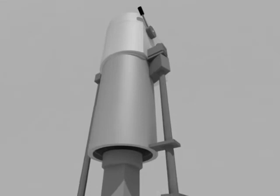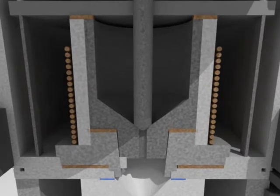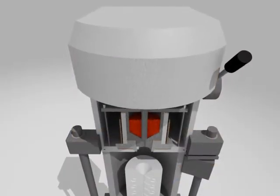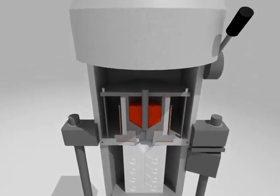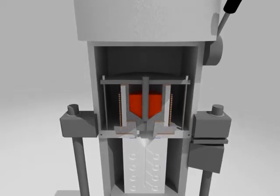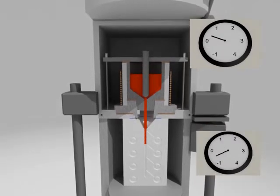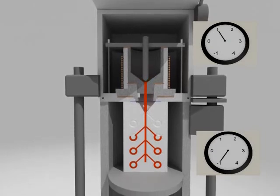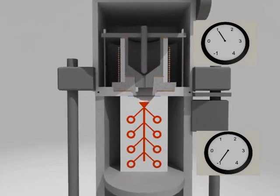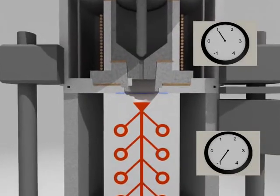In the separate chamber machines, the syringe effect is guaranteed by special gaskets and cements underneath the crucible to keep it sealed. After the vacuum is applied, the flask is pushed against a silicone gasket and inert gas is supplied. When metal is molten, it's poured into the flask. At the same time, a gas pressure is applied to the crucible chamber at 1 bar maximum. When the crucible gasket and sealing are proper, the gas pressure will push out the metal from the crucible by increasing its pouring speed, while the vacuum pulls it.